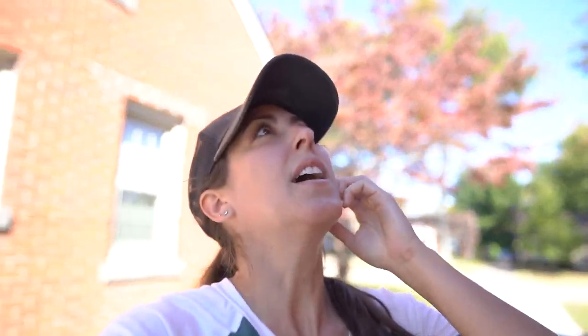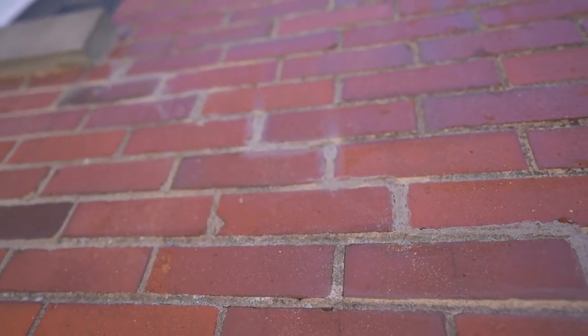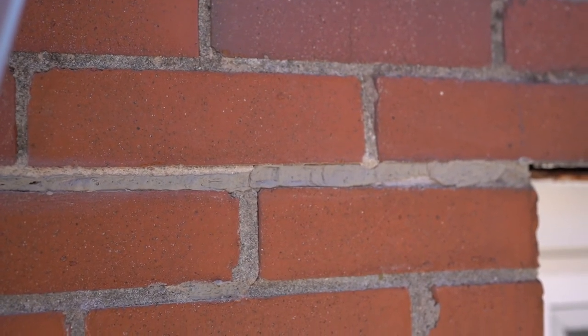Since it's acrylic based, we will have to prime these areas before we use the paint, but that's going to be really quick and easy. For some of the easier cracks that weren't very deep — they chiseled out like they should — we're just going to be using this caulking. But on some of the deeper ones where he started chiseling and it just kind of all crumbled, we're going to actually mix some mortar and do a proper mortar repair.